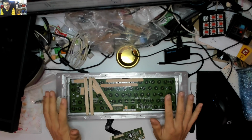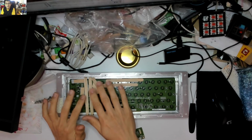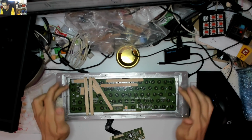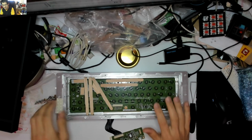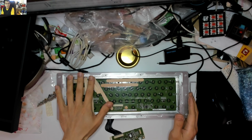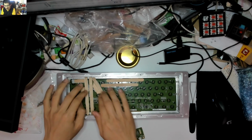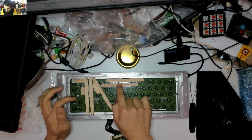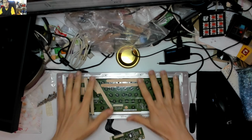Now, I know it looks terrible and it's really weird and it's really clunky, but I have faith that it works. So what I've gone and done after I've fitted the 6 mounting screws for the actual entire assembly here is that I've used double-sided stick tape, quite strong stuff, to stick down these craft sticks. Now, their positions are a bit weird, but the reason for that is because I couldn't put them over the top of where the screws are to take off the PCB.